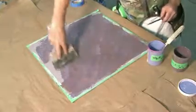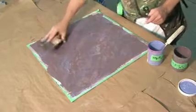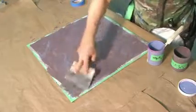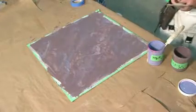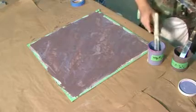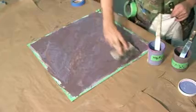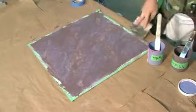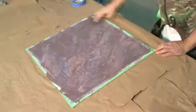TO stone is an acrylic plaster with a small black sphere that can be tinted to any color and troweled over our Venetian plaster in as many tones as is required to create the desired effect. When the TO stone has dried, hone the plaster with a trowel edge to create tonal drama from the Venetian plaster underneath.